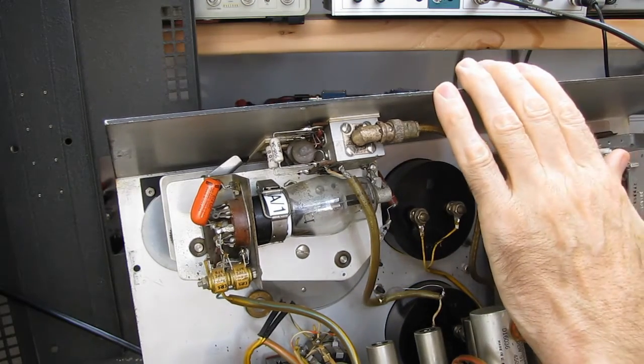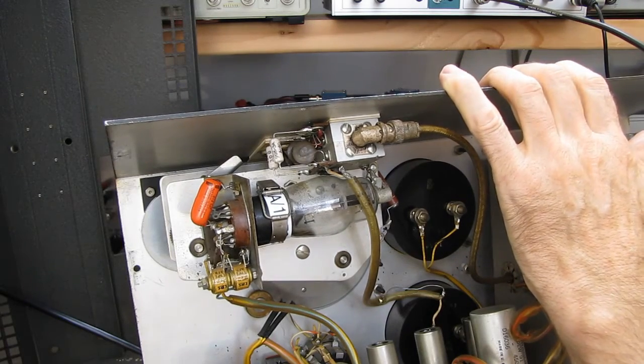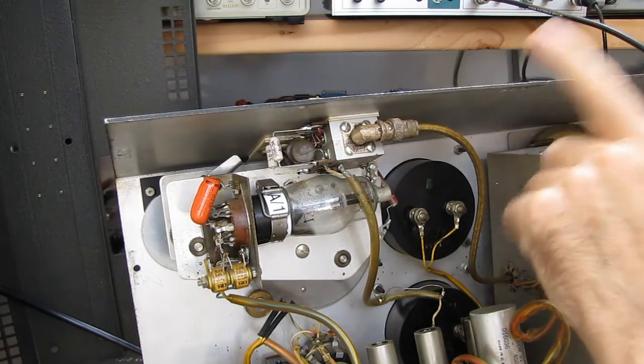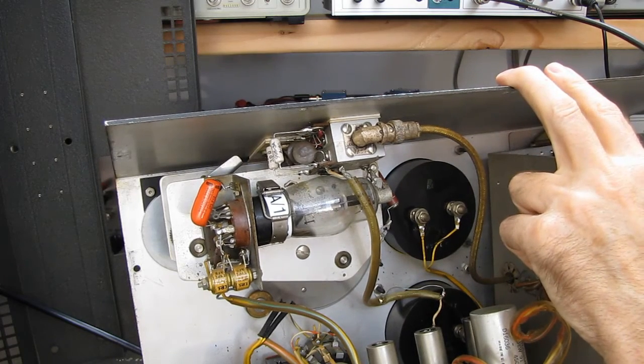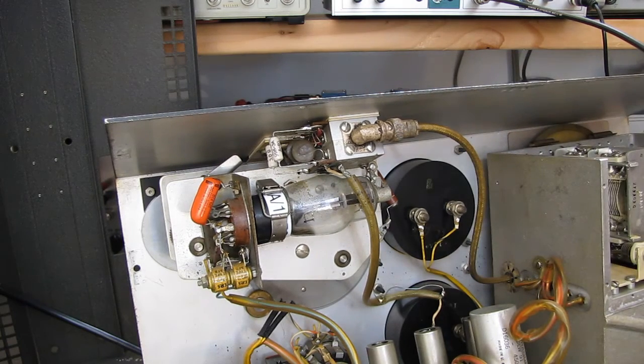But with one of these, you can test your coil form material before you wind your coil, whether it's for an antenna or for a transmitter. If you're doing low band work, if you're using Litz wires to make big loading coils, you want one of these because you can test your design to see if one design beats the other for quality. You're only allowed, what, half a watt or something? You want the maximum radiation efficiency out of your coils. Should your coil be taller and narrower or wider and squatter? You can wind both, and you can test on this unit which coil is going to be more efficient.